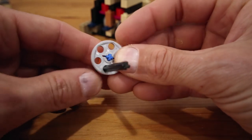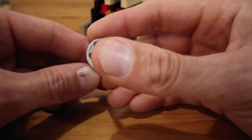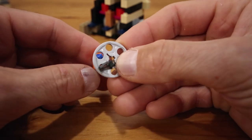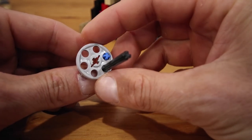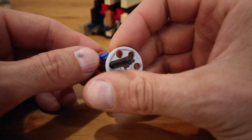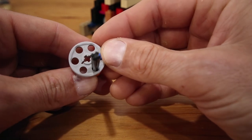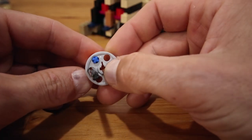With the pin running through the center hole, the adjacent hole to the left, or the adjacent hole to the right — so relative to the orientation of the lift arm, we can mount it at zero degrees, minus 60 degrees, or plus 60 degrees.